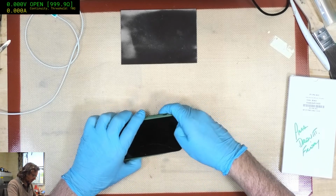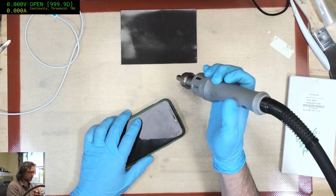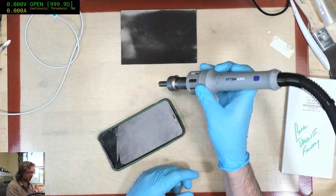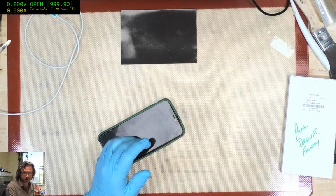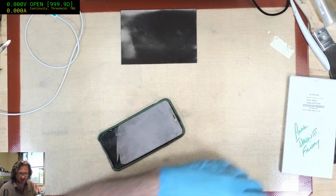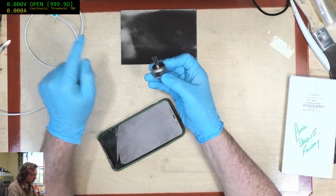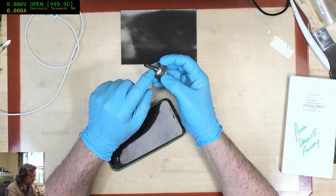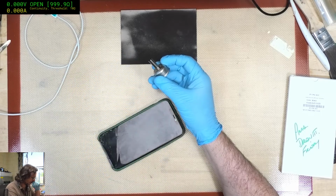The two main factors that I ran into was that when you use your hot air wand, the traditional ones are just so wide that you really can't get a good angle on your board. Hence a lot of people would use angled tips to compensate for that. But I don't like angled tips because they do them poorly, because they just insert these at an arbitrary angle, be it 30 or 45, rather than the proper way, which is to actually fill it with sand or something like that and then actually put a curvature on it.